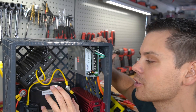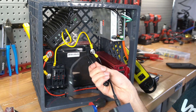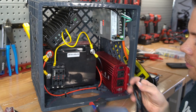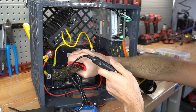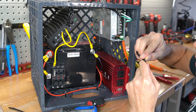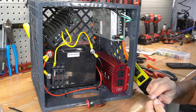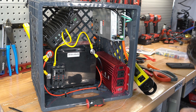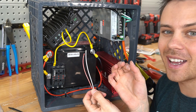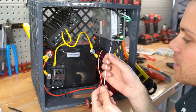Next we need to add the USB chargers. I'm guessing we should mount it near the AC inverter. You do have a long extension cable, so you could have this outside of the box if you need to — for a van or RV system. First step is cutting off this cigarette lighter adapter. Stripping this wire is difficult with the cheap tool, so I'm just going to strip the wires with scissors. Now you have two wires — that is the most difficult part of this system build, as it's very hard to do without damaging the internal wires.